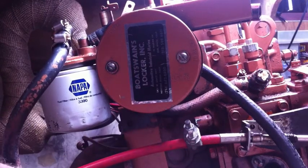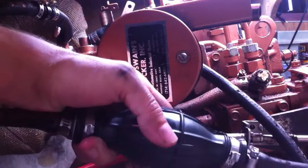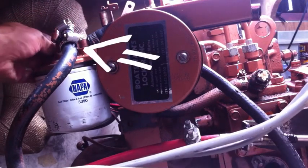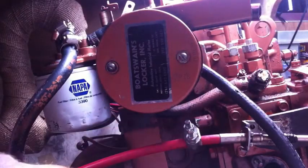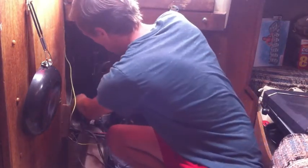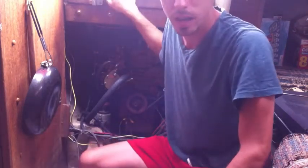I still had no luck with the automatic fuel pump, so I've connected this manual pump directly to the fuel lines — it goes directly to the fuel filter where I have the first bleed valve, which I've bled through, and then I also bled through the second bleed valve. We're going to try to start it from here. Basically we've given her an artificial heart for now. I'll finish bleeding it and we'll start it up and see if that works. Thanks for watching.